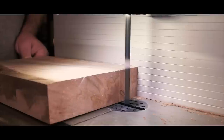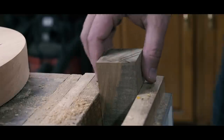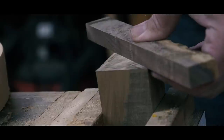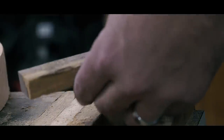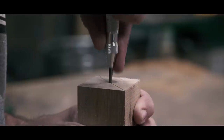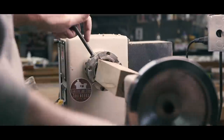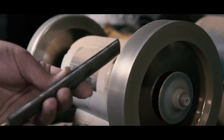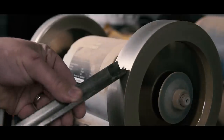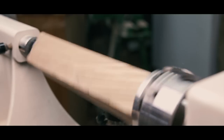With the seat done for the moment, I could turn my attention to the legs. I have some mineral-stained spalted silver maple I had milled some years back that I thought might be cool for the legs. I cut some square blanks at the bandsaw. With my leg blanks roughed out, I found the centers at each end, then punched the centers and headed to the lathe. I already had the chuck installed, so I used the jaws on one end and the tailstock in the center I punched on the other. I made my square into round using a spindle roughing gouge.